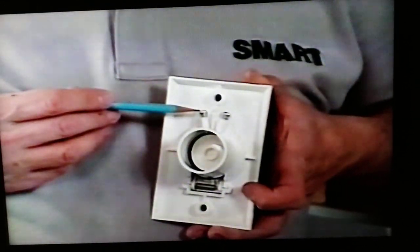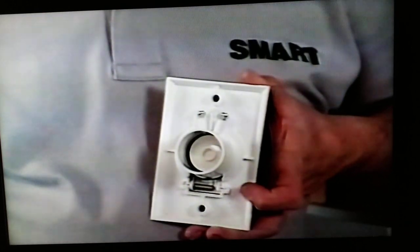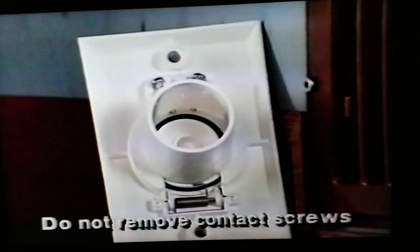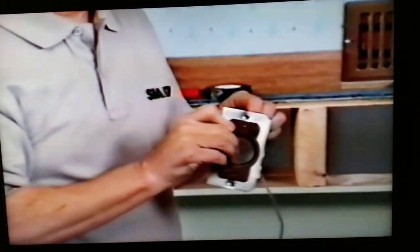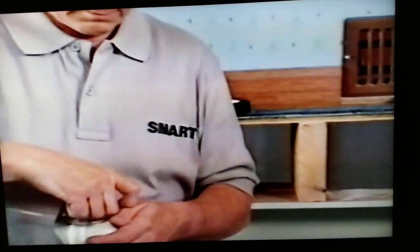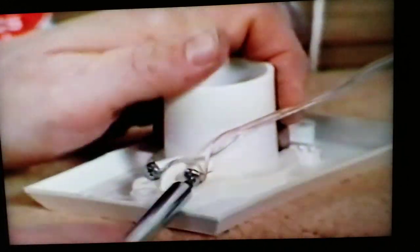Look on the back of the face plate — you'll see two small contact screws. These are the terminals to which you attach the low voltage wire. They've been turned out at the factory the proper distance to take the wire. Do not, under any circumstances, remove the contact screws. If you do, you may lose the spring holding the contact in place. Strip the ends of the low voltage wires and then pass them through this wire guide hole with six to seven inches of excess. This will allow for future repair or maintenance to the inlet without running short of wire. Connect the stripped ends to the inlet valve contacts — either terminal will take either wire.